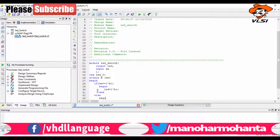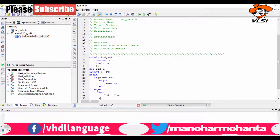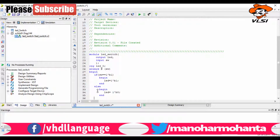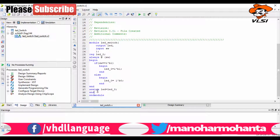The logic is: if switch equals 1, then LED will be on. In this video I will not be writing the output as a register directly. I have declared a small register — led_0, initialized to 0. In the always block, triggered on the switch input, I begin writing the code using an if statement — this is a behavioral model.